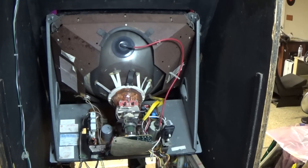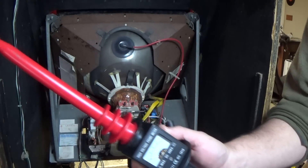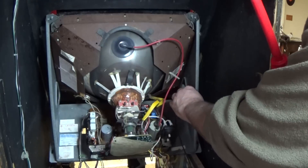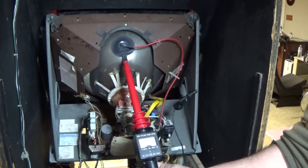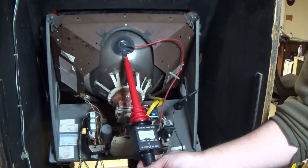Right now this thing is on and powered up, so we'll go ahead and turn it off and unplug it from the wall. Grab your high voltage probe — if you don't have one of these, I do have a link in the description. This is kind of a must if you're working on this kind of stuff — safety and just proper. Clip it, then go right underneath, and you'll see it go right down to zero. Just hold it on there for a bit and make sure we get all of the juice out of there.